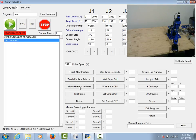We've got move home and exit home. As we talked about in the last video, those are just quick buttons to give you a shortcut to move off the rest and then back onto the rest. We have the delete command which will allow us to delete a row. We have wait time in seconds, so I can make the robot wait for a certain amount of seconds.